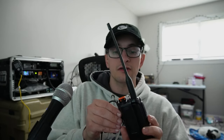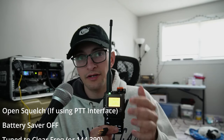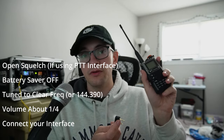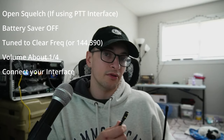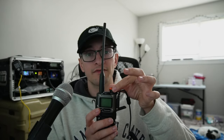If you are using a push-to-talk line, your radio needs to have open squelch — meaning audio is always coming out, whatever it's hearing. You also need your battery saver disabled, as that cuts off the receiver periodically and can really mess up packet radio. Tune to either an unused frequency or 144.390, the universal APRS packet frequency. Set your volume knob to about 25% to start, connect your sound card and PTT interfaces, and you're ready.